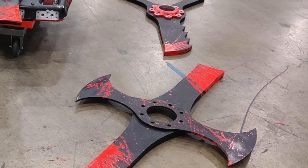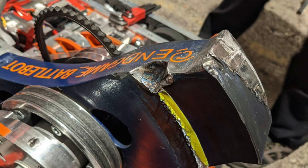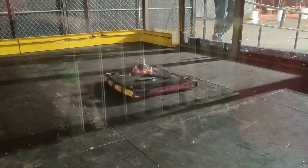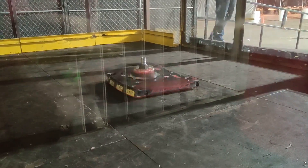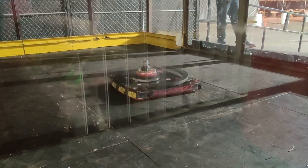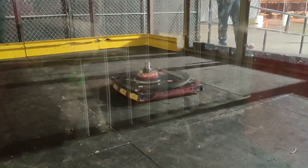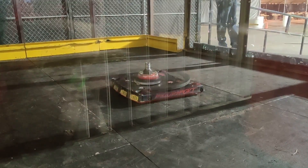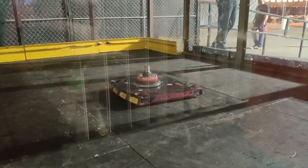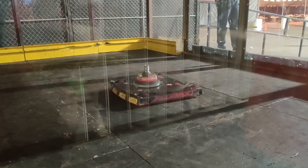This is why the thick bar for 2020 is longer, at 42 inches, and symmetrical — and it worked! We still had enough bite to hit the back of Endgame's weapon. As for the Key in the future, it's the lightest option among our current array of weapons, giving it the best spin-up, and it's still quite strong vertically. We think the best use case for this weapon would be against aggressive, low-reach drum spinners like Minotaur or Yeti, or in fights where we absolutely need to stay spinning as a defense, like if we were to fight Quantum or Kraken. Its light weight also gives us flexibility if we ever need to come up with a new armor setup on the fly.